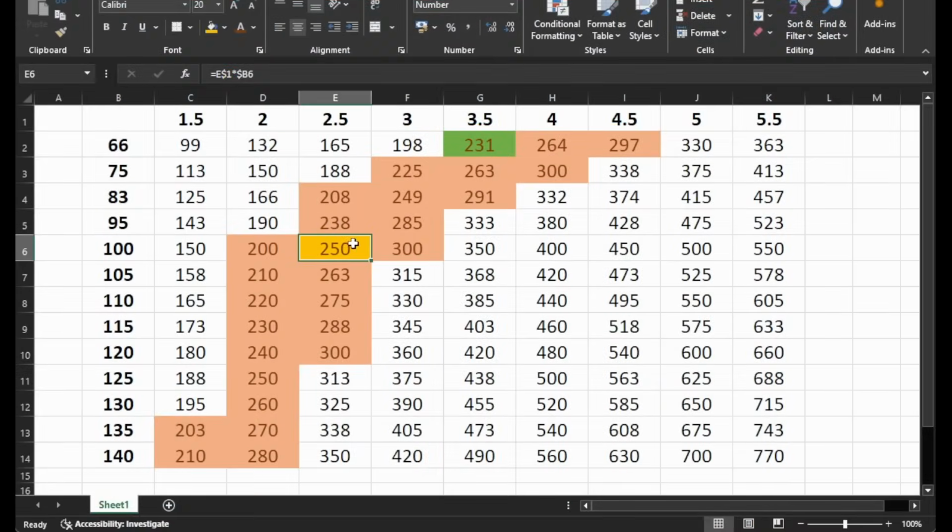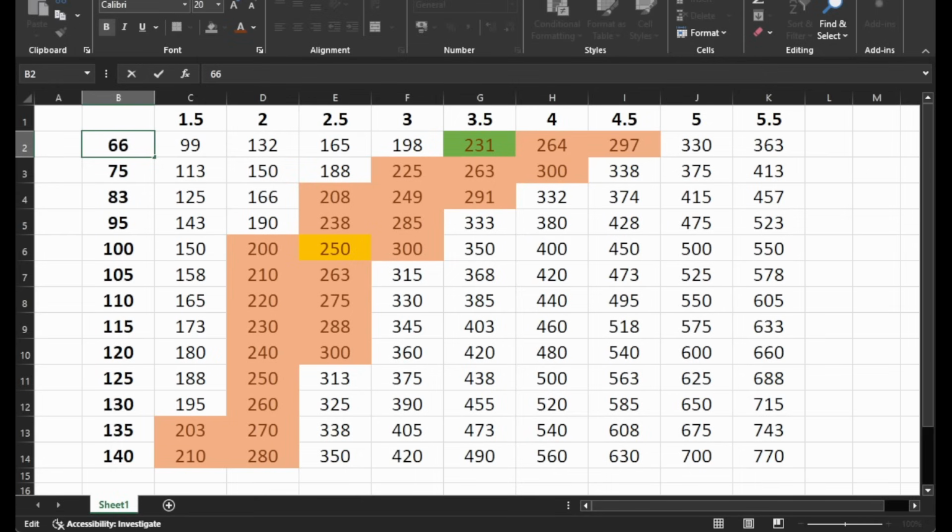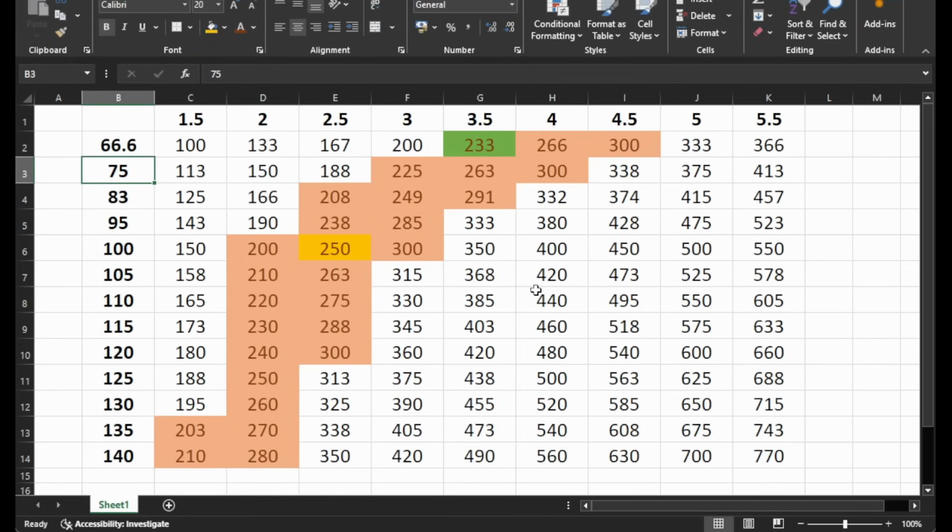So this one is running right now, 250, 275, but then we are pushing a lot higher with the front side bus. Can we go somewhere else? 270, no, there's nowhere 270. Next one would be probably 265 or something like that, or 266. This will probably be 266. I should really change this and call this 66.6. Now we get the correct values here. So this would be 266. Maybe this is the next step. Go back to 66 megahertz frontside bus and try 266. So this is the next one.